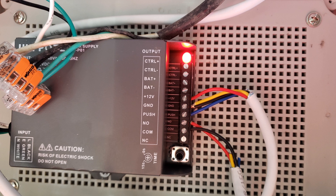This is all within an electrical box to protect everything — protect the circuits. We mounted this electrical box high above the door so it's easily accessible to make changes as needed later on. When you automate this whole thing, you'll connect the Shelly 1 into the push as well as the COM. Use a piece of wire to make the contact from push to COM and then the door strike will release immediately. These two contacts — COM and push — are where we'll be using a Shelly 1 to relay and release the door strike.